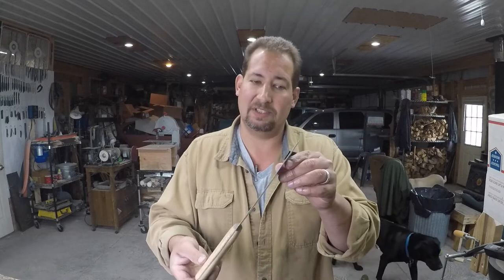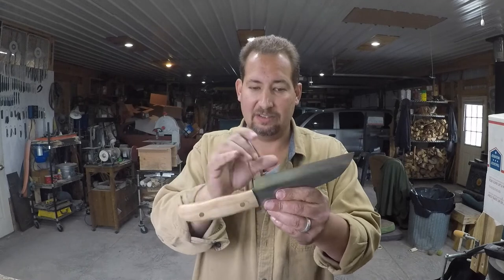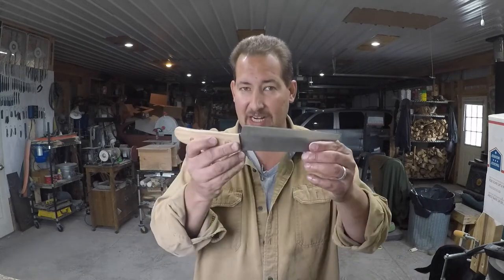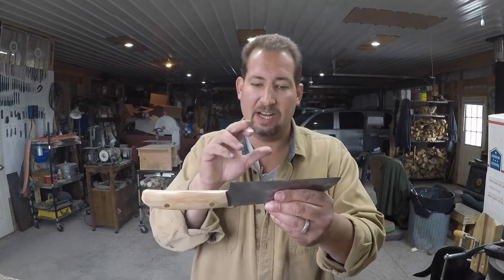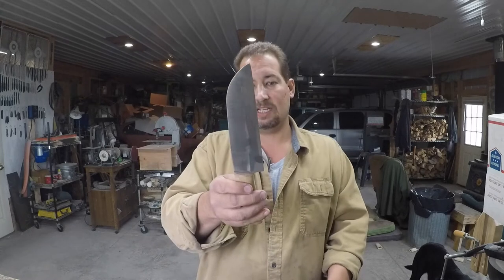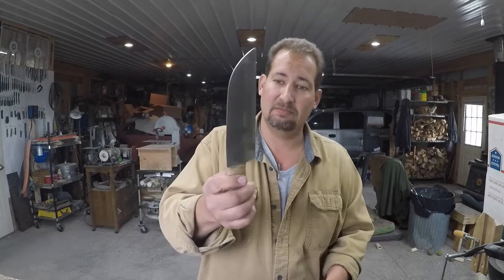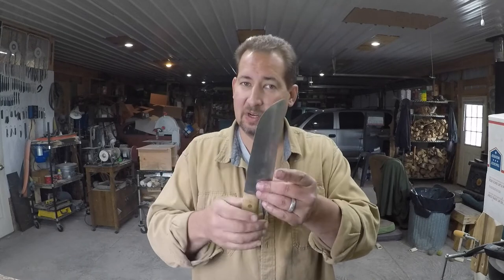I thought I was grinding thin back then, and I really wasn't. This knife is a hard 1095 steel, but with a geometry that's dang near as thick as the Faberware. So in that case something is wrong - this is a very unbalanced knife. You've got hard steel with a good heat treat but with a poor geometry for the intended use. If this was a meat cleaver it'd be perfect, but this was my first go at a Santoku maybe. I don't know what I was thinking when I ground this thing - a Santoku should be quite a bit thinner than that.